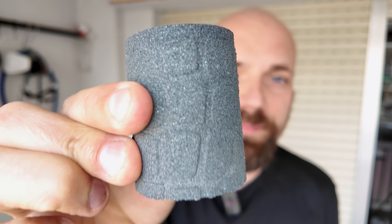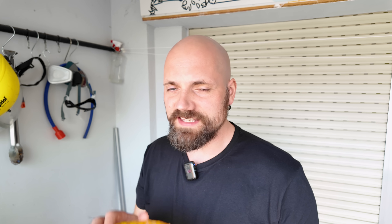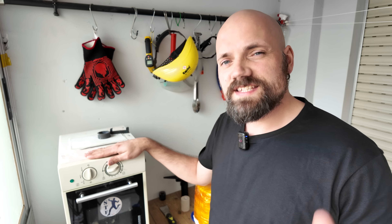Why silicon carbide? Because silicon carbide absorbs microwaves and heats up — that's how the metal melting is done, since the crucible is also made from it. Here's the amazing part: you don't need a microwave kiln or chamber at all. You can just burn out a silicon carbide mold by placing it directly in the microwave. I want more people to know about this because it can be a game changer for hobbyists and small artists — instead of buying an expensive burnout oven, you can use a microwave you picked up secondhand.